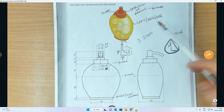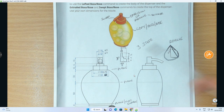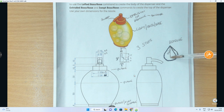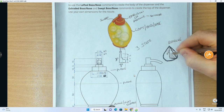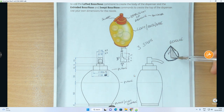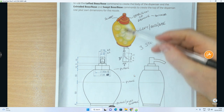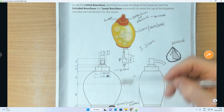We're going to use a revolve instead. The principle of a revolve is: imagine a triangle with an axis line — if that triangle stays where the axis is stationary and spins around, revolving around it generates a cone. That same principle can be applied to this section if you can recognize the geometry.